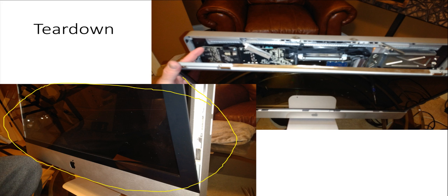It's connected with magnets to the screen itself, so you pull that and put it aside — make sure it's in a safe place. Then if you take a look along the bezel, all around the edge there are screws that you'll need to take off to pull the actual screen away. You don't need to take the screws that hold in the antennas on each side, so go ahead and leave those in or they'll just dangle.